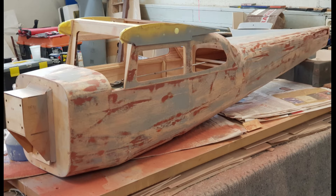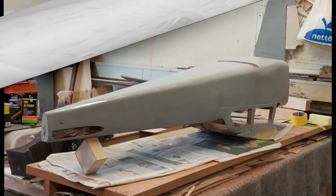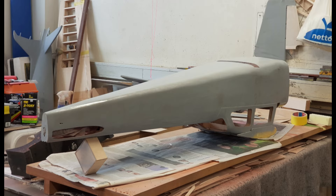Day 59. I have finished sanding the fuselage, adding filler and then sanding it down. This has been a lot of work but extremely enjoyable to see the fuselage skin becoming nice and smooth. Then I sprayed a thin layer of primer on the fuselage. When this has dried completely I can sand it with 400 grit sandpaper and then put filler in any dings I missed the first time.